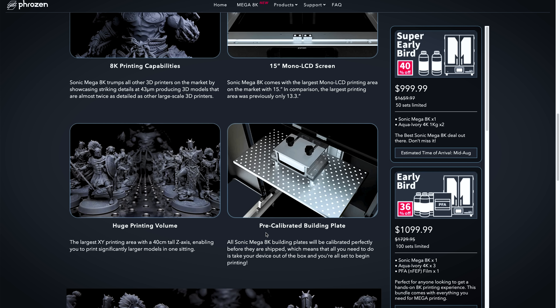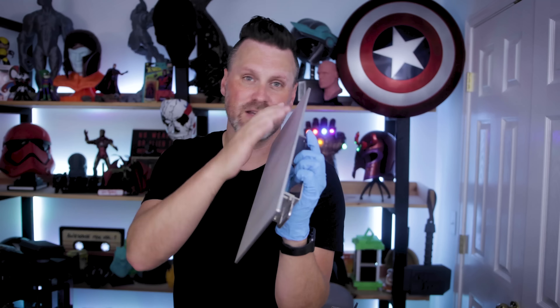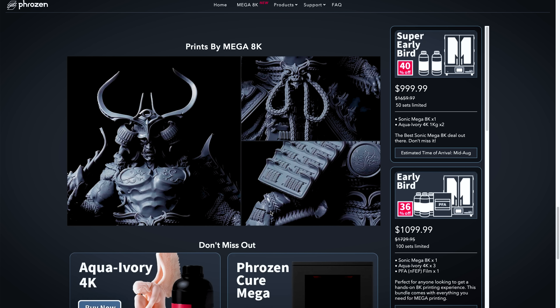One of the things I wanted to call out that I'm not a huge fan of are these huge perforated build plates. It's great for adhesion purposes, but it's a pain to work with because you will get cured resin inside those holes and you have to continually try and pop them out after each print. Plus resin tends to pool up in there — it just makes for a messier experience. I recently purchased the standard build plate without all the holes for my Transform to alleviate that. It's just something you need to be aware of when working with this larger resin printer. The prints they're showing off look amazing, which is no surprise given the high resolution of that 8K screen.